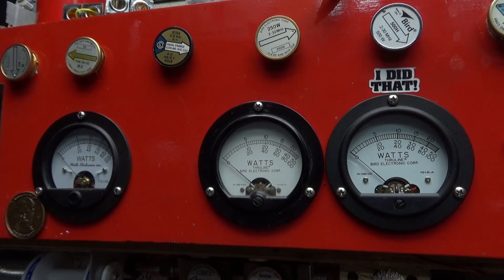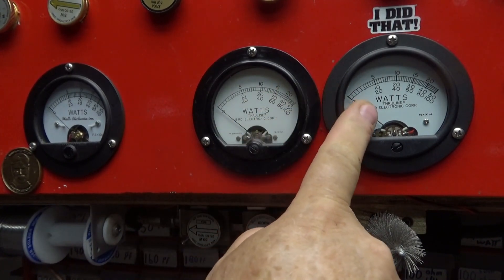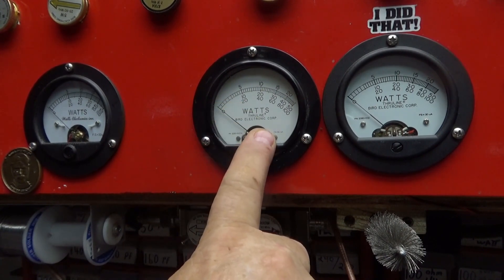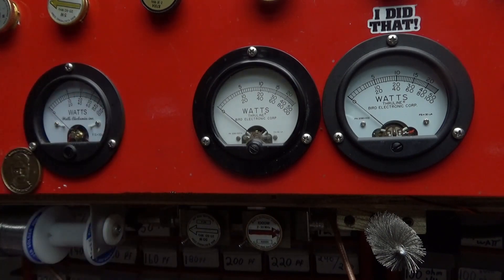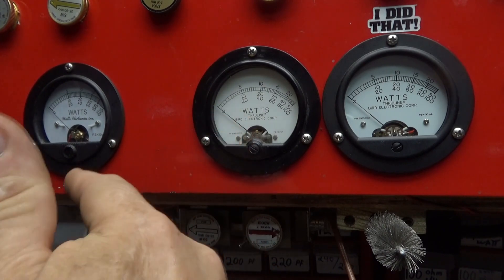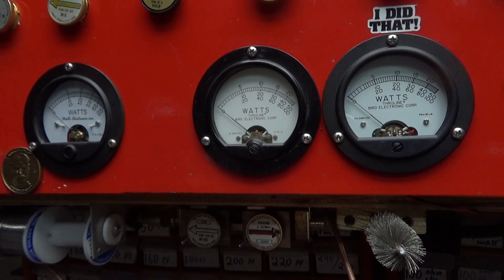I'm gonna do it without the sideband delay on because it's on AM. This is the RMS — it's a thousand watt slug on this meter, represented here. 50 watt slug here on this meter, which is the reflect back from the antenna. This is on antenna, this is the reflect going back towards the radio. You want this as low as possible — you don't want any reflect coming back from the antenna if you can help it. You try to tune that out.